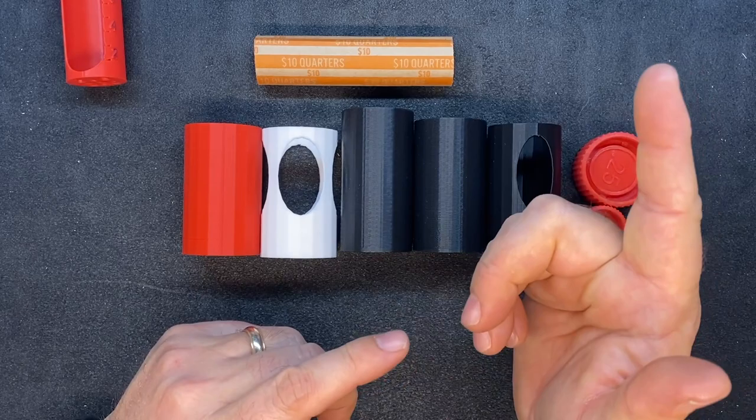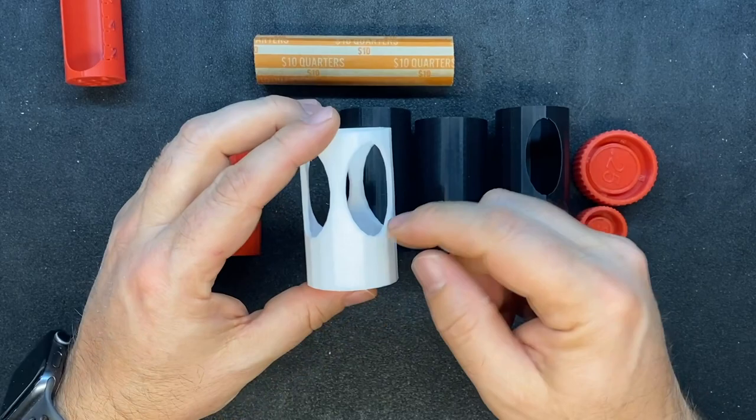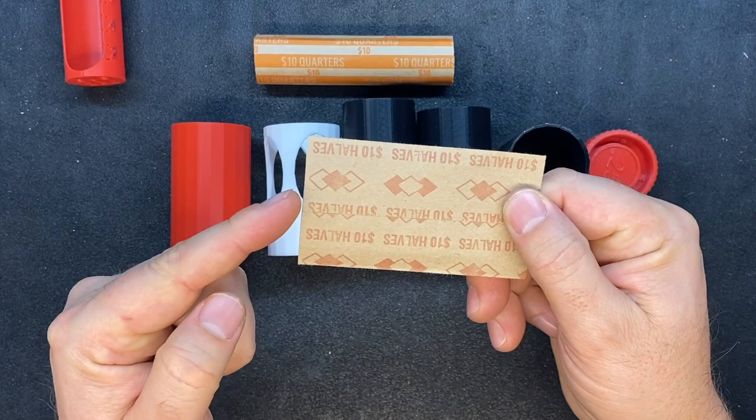What I can't do is half dollars. The machine I have only does the main denominations — it doesn't do halves. So I got on a tool called Tinkercad and started playing with some designs. You can see, hopefully in the light, I've got different kinds of insides, and to reduce the amount of material that I use, I've put holes in some of them. You'll see they're different heights because I was playing with a little cap inside, so that when you go to refill your coin rolls, you get just the right amount of wrapper left over.